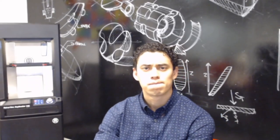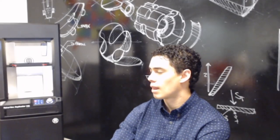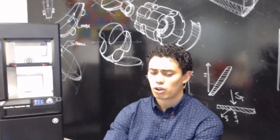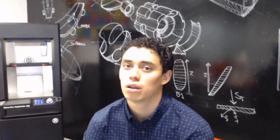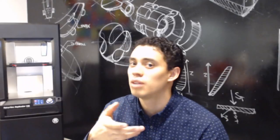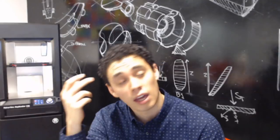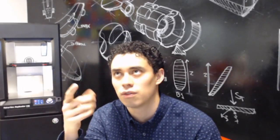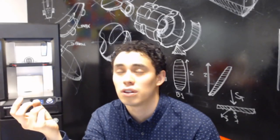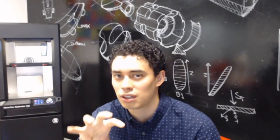I believe it does, but sunlight really only melts or warps PLA after a long time. There are two things, and I'm not sure what problem specifically you're talking about. If you mean melting, it's a thermoplastic. So with any plastic, if you increase the temperature high enough, if you go higher than, say, 40 to 50 degrees C, and 50 degrees C is going to be like 110, 115-ish Fahrenheit, you'll see some melting and some deformation.